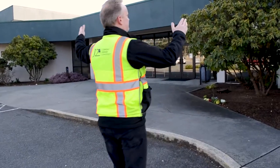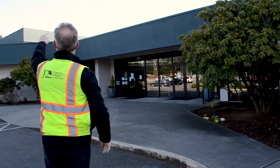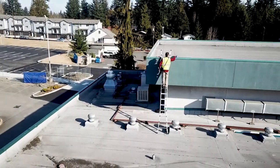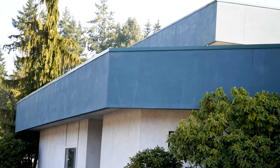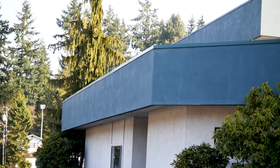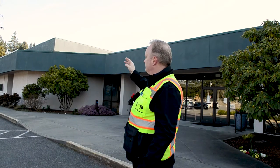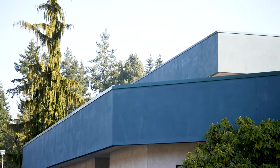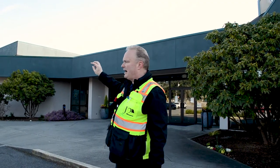Here's a good perspective: you can see the coated stucco on the lower level, and the upper band hasn't been coated — you can see lots of little cracks through there. This coating is about 10 years old, so you can start seeing some cracks coming through. The coating gives you extended life, but it's not going to fix any wetness under the stucco — it'll just help deflect water for a short amount of time.